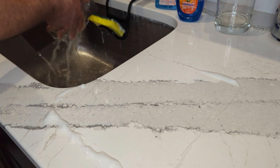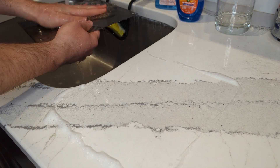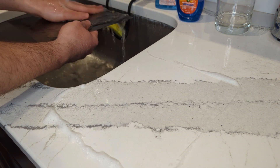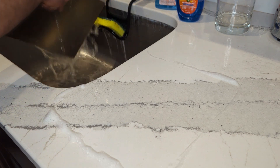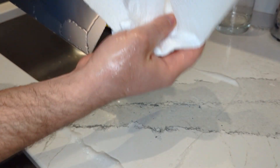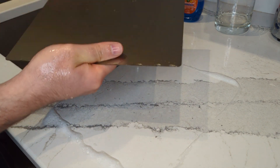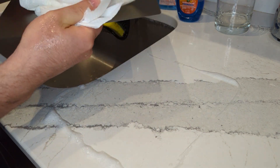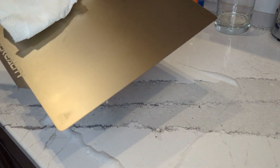Be careful with the alcohol — it can damage your bed. This is the PEI bed and it was about time to clean it for me. Make sure to give it a good rinse with warm water — definitely not too hot or too cold, just warm. Then use some paper towel to wipe it and make sure to dry it out. Don't forget both sides.